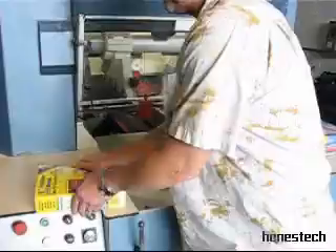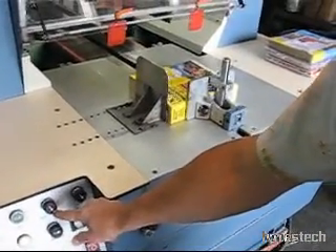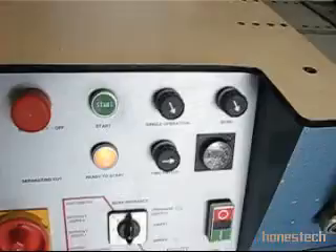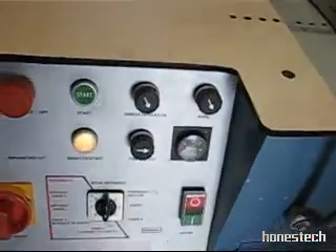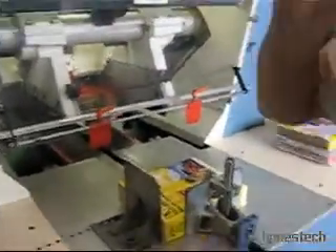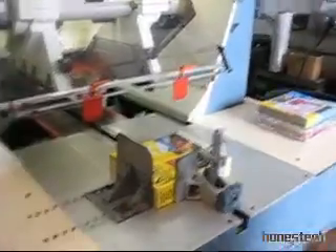When you're going to operate the system, you put your book in to the clamp. I have it set right now for a single operation — the switch is aiming down, which means it's not on automatic. With this aiming down, it's designed for the clamp to grab the book, bring it in and cut it, and then bring it back out to you on this side. I would suggest operating the machine this way for a while. You don't want the books going out the back end along with the paper trim unless you have two people running the machine.